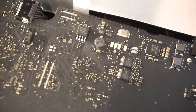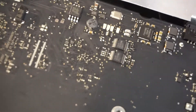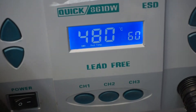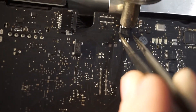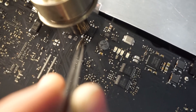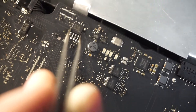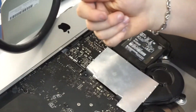So right now what we're going to do is we're going to grab our heat gun. Right now I'm using 480, so just under max heat and 60 airspeed — just over half airspeed. Normally it wouldn't be taking this long but I'm doing this in the chassis and I don't want to give it too much heat, that's why I have it on lower settings. You can see now, just to cool it down, it's revving up to its max airspeed.